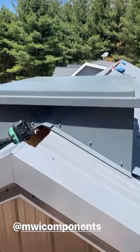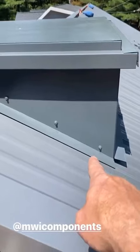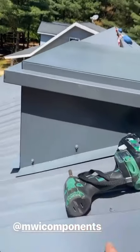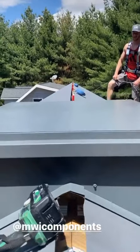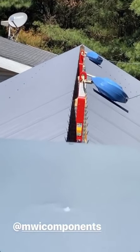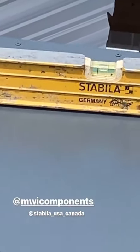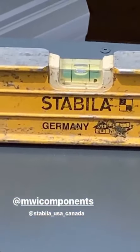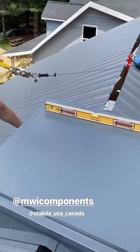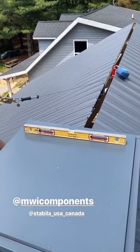We'll finish it off with our eagle weather vane, which is hard to see there with the trees in the background. Just put the cupola base up on the roof to set it there — looks like our pitch is perfect. If you're running level, look at that ridge, Greg. It's pretty darn straight. One thing you definitely want to do is make sure that your base is level so that your cupola top when it goes on is also sitting plumb and not crooked — that's the last thing anybody wants to see.